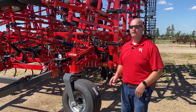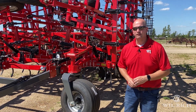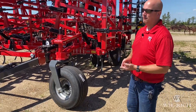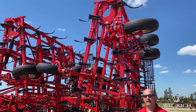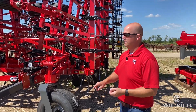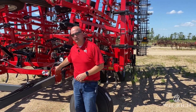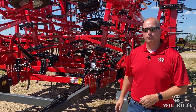The difference between them is the floating hitch — the QX2 is a floating hitch machine. This machine is a QX2. You can see the caster wheels up front and across the front. Both machines still have hydraulically controlled gauge wheels to help control depth. The QX2 up front also has an optional weight transfer kit that puts weight on the hitch of the machine for transport purposes.